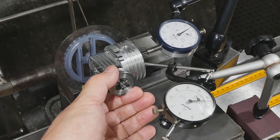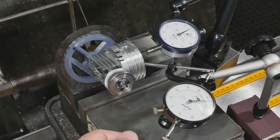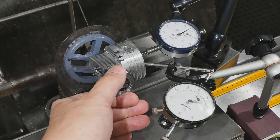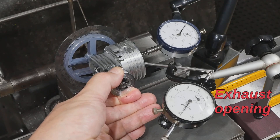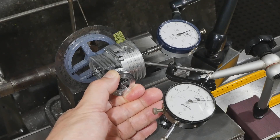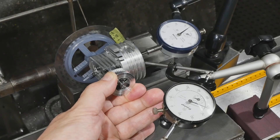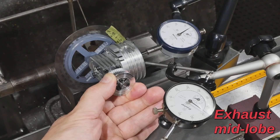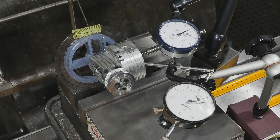We keep going — both valves are closed now. We come around to where the exhaust starts to open: 55 degrees before bottom dead centre on the crankshaft, or about 242 degrees measured on the camshaft here. I can feel it's just hitting the mark there, so you can see the exhaust opening now. It should hit its midpoint at 110 degrees before top dead centre on the crankshaft, which maps to 305 degrees here on the camshaft. There's 300, and you can see the exhaust valve is at maximum opening now around 305. So that's good. Then back to the start — I think within reasonable tolerance my camshaft is correct, which is a great relief.